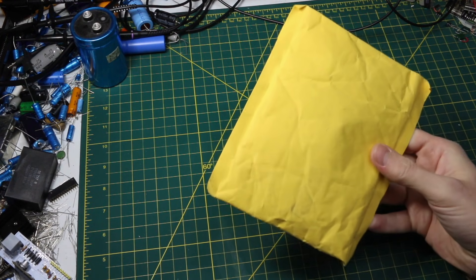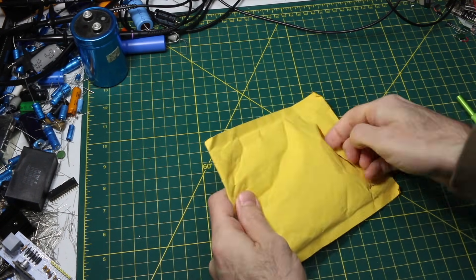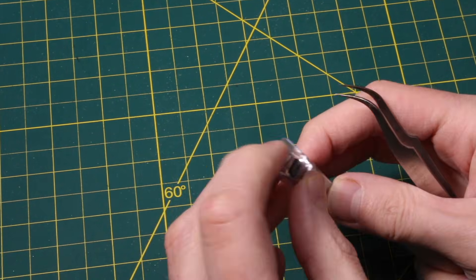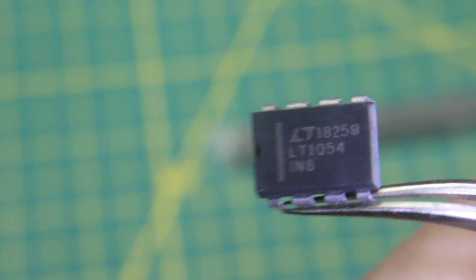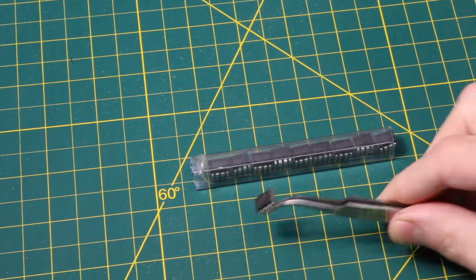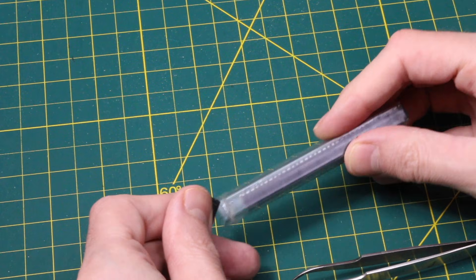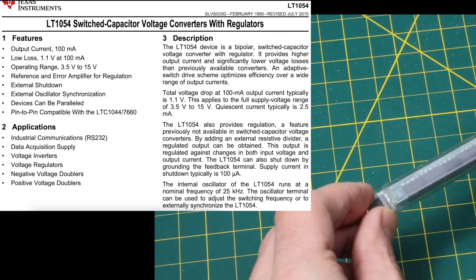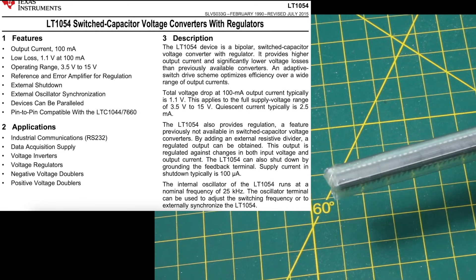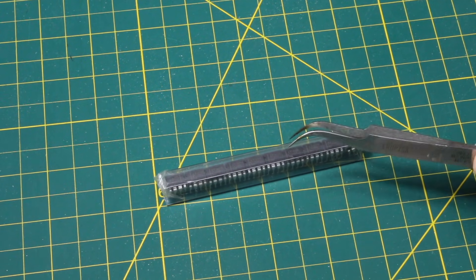A good place to start is something that sounds like parts in a tube — and it's hard to see through the tube. I usually get op amps, but this is an LT1054. Finally under the right magnifier I could see it with light. Assuming the part is either genuine or a working clone, that would be a switched capacitor converter chip compatible with something like a Max 1044 or 7660, which I use to make negative supply rails out of positive rails.